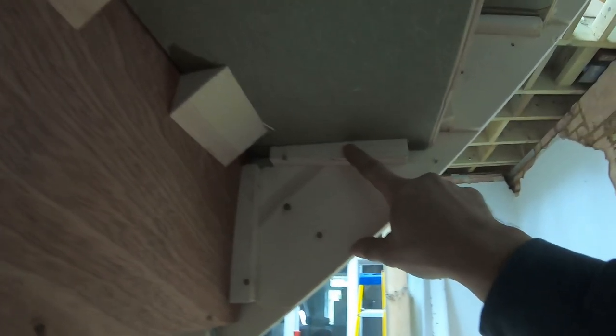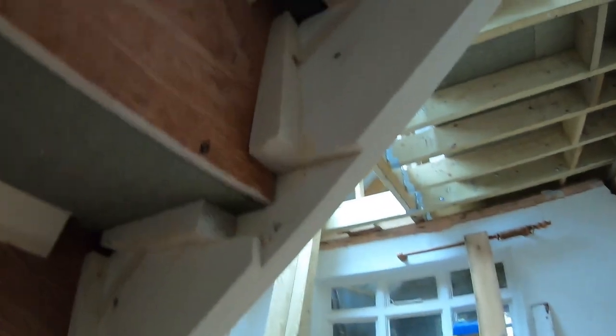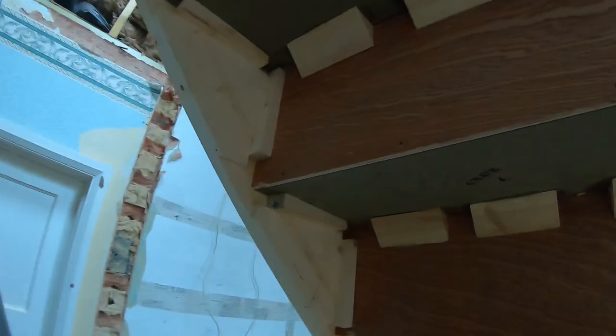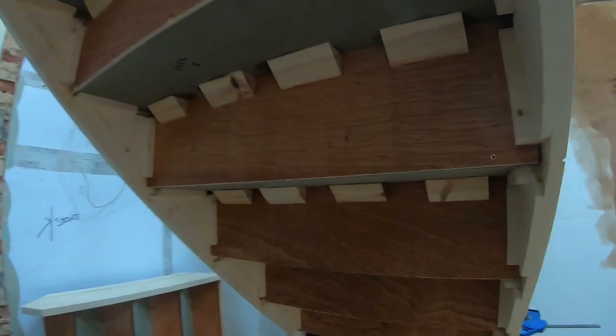And also sometimes I had stairs which were old, and because stairs dry out, these need to be knocked back in. So these don't get glued, they're just knocked in. Usually, well, they have actually glued these, but that is your adjustment basically to tie it all in. So that's another tip, what you could use if you've got a flight of stairs which is squeaking.